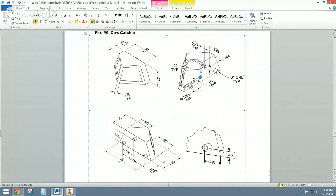As you'll notice here, this is dimensioned with a cutaway surface with an exploded view where I can see a sort of detailed view right here. You'll notice they dimension the bottom as 1.8 across, and they dimension the top as 1.2 across. They dimension how wide this is by 0.75 inches on the top and 1 inch on the bottom. Notice it is not a simple drawing the bottom, extruding it to the top.